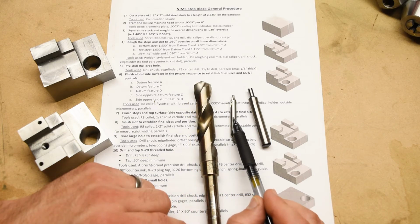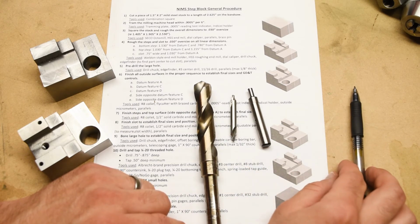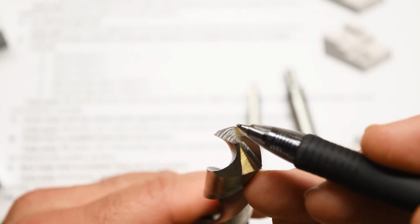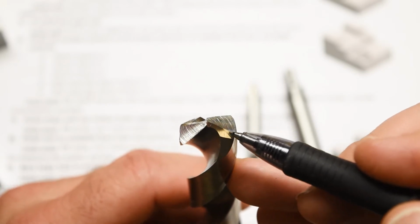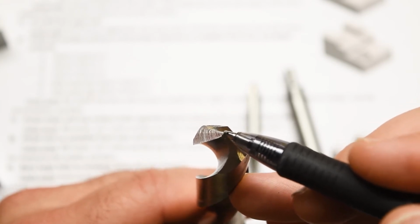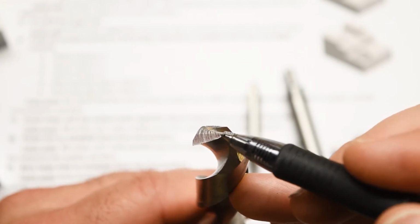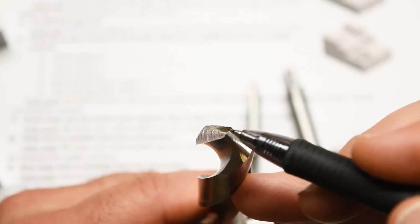You can see that we're going straight from a center drill to this big drill. Now normally this is big enough that we would have to pilot drill it. However, this is a special split point drill. Now we've talked about split point drills before, but just to reiterate, okay? Here on this drill, you've got 2 primary facets, and then behind the primary facet, I mean the grind, there's 1 more secondary facet there, and that secondary facet comes up all the way to the center of the drill right there and splits the point, meaning it takes out half of this chisel edge, which is where the 2 cutting edges of the drill meet, or rather don't meet, because of the material that is in the core of the drill called the web.